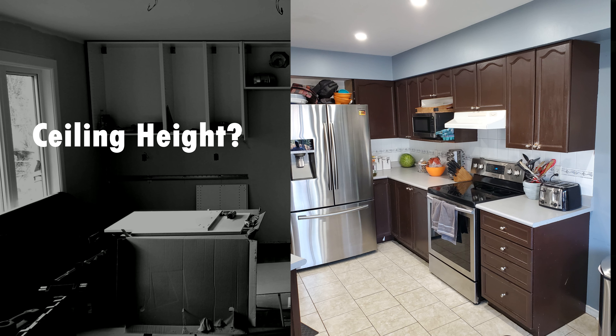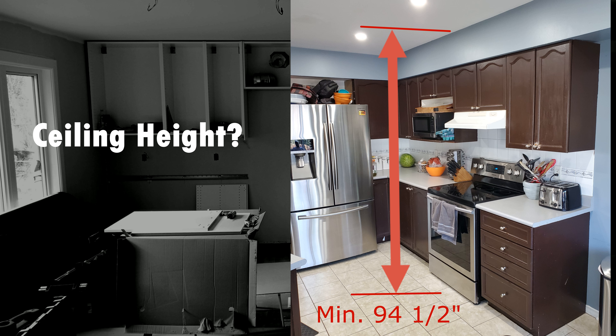Next up, and equally important, is the ceiling height. What if you don't have sufficient ceiling height to have cabinets running all the way up? If you take the bulkheads down, you have to consider: do I need to take those bulkheads down just to put up something else to close that gap from my 30-inch wall cabinets to the ceiling? If you don't have 94 and a half inches from the floor to the ceiling, you're not going to be able to squeeze in 40-inch upper cabinets or 90-inch pantry cabinets. So taking down those bulkheads can be wasted energy if you have to go with 30-inch upper cabinets and 80-inch pantry cabinets.